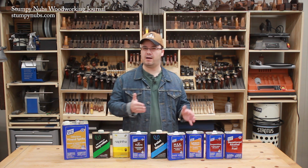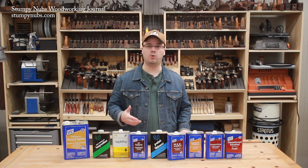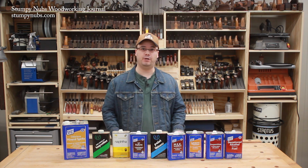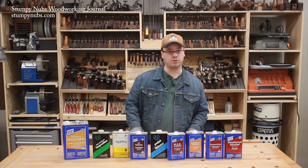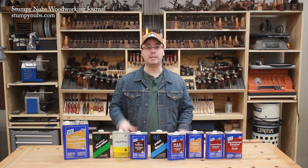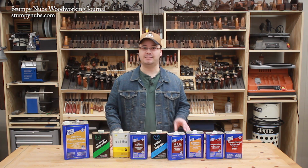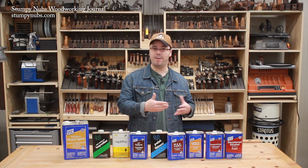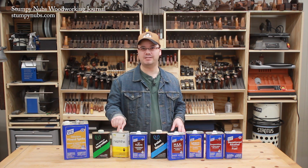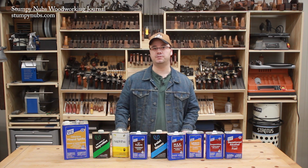Toluene is a little hard to find in the average hardware store, but xylene finds its way back into our workshops in cans like these and under the brand name Goof Off and Oops. One of its principal uses for woodworkers is to soften dried latex paint, or as a last resort for removing some wood glue residue you missed before finishing. Xylene is also useful for cleaning raw metal before applying a finish, but naphtha will work just about as well for less money, and the fumes are less harmful, although I'd still take precautions.